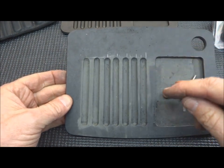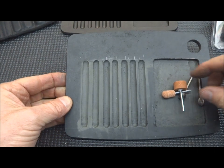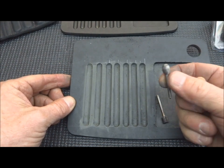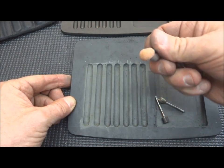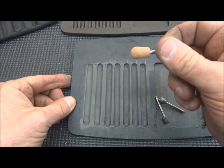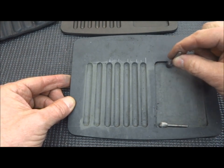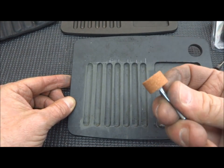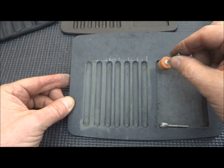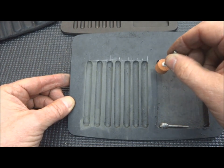It's not perfect — I had a couple of slips as you can see — but they'll hold the pins and that's the objective. If you don't have the carbide bits or don't want to spend the money, the cheaper ones will also work perfectly. The shape on this one is actually a little bit better for getting the grooves. Likewise, if you don't want to buy the carbide bit for the squared-off edge, you can use the stone as well and it'll work perfectly. When I drew the corners, I either use the curve of the bit I'm using or I'll take a coin to make that arc.